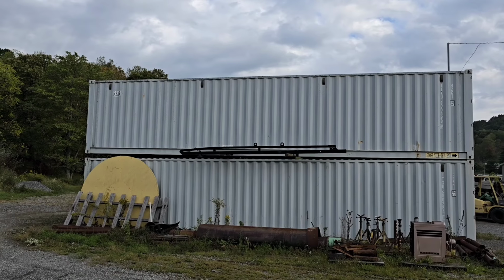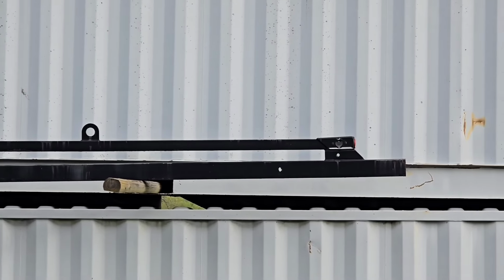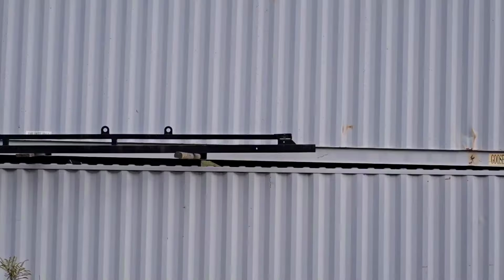Well, I had this boom hanging off the side of my truck, with a winch out there on the end. And I was driving right down through that line, and I would drive up to the first well, take the wireless remote, let the 20-inch beveling machine down, latch it on the pipe, cut off the pipe, hit my remote, lift it up, drive to the next well, back down, cut it, back up, drive to the next.